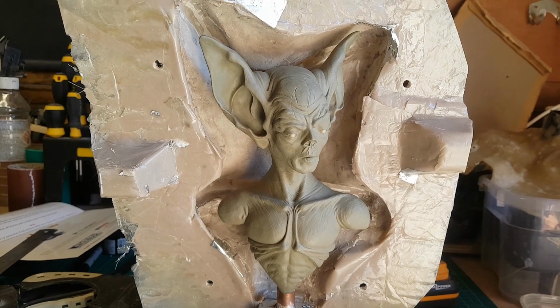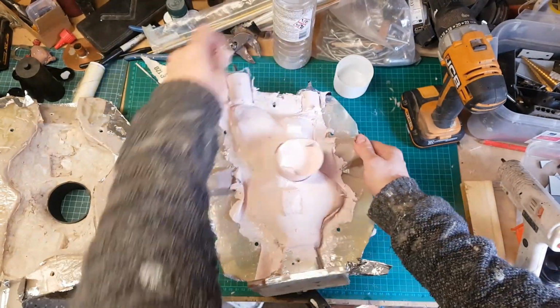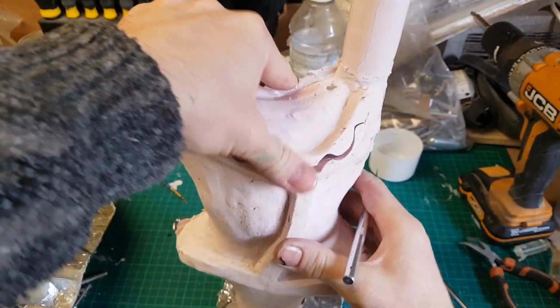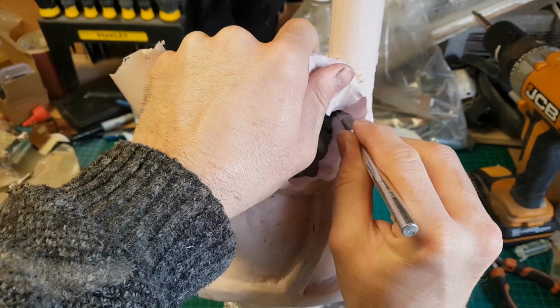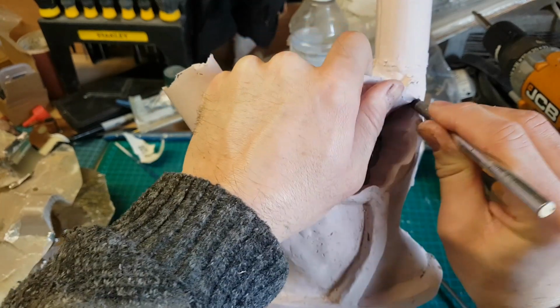That way I've got a layer of silicone all over the sculpture that hugs the surface of the sculpture quite closely. So I'm saving money because I'm not using too much silicone, but I also can now cut the silicone as opposed to relying on a mould line, and if I cut it I should then get a much smaller divide than I would do otherwise. So that seemed like a good approach, and that's what I decided to do.